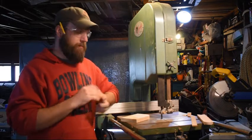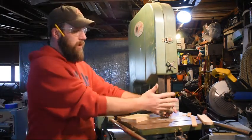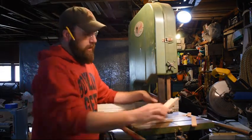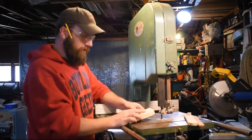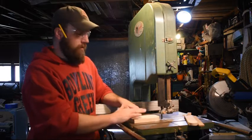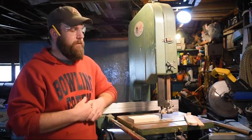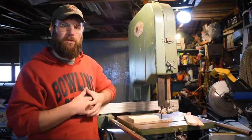In review, some of the most important safety guidelines for operating the bandsaw: first, make sure the guard is adjusted correctly — you want it approximately 1/8 of an inch above your piece. Have push sticks ready to be used; if your hands need to be any closer than four inches to the blade, you should have a push stick in that hand. Because the blade moves in a downward rotational direction, the piece must always be flat against the table rather than elevated or even slightly angled. Of course, wear safety glasses, remove rings, watches, and bracelets, roll up sleeves, and do not wear gloves. Also make sure to restrain loose clothing such as hoodie strings and long hair.